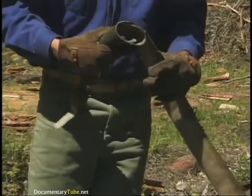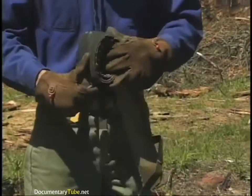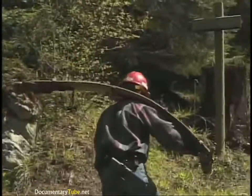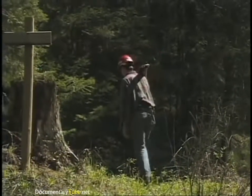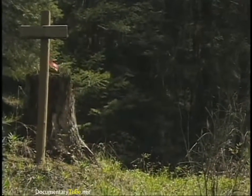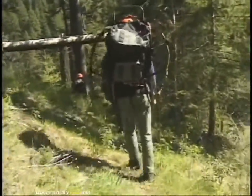And if you've taken your gloves off to tie the knots in the string or to remove the Velcro and then pick up the saw, it almost burns your hands, and I've seen people drop the saw suddenly. If you're not going terribly far or with a shorter saw, you can put it on your shoulder with the teeth facing away from your neck, take off the rear handle, hold on to the front handle, and carry it that way. You wouldn't want to leave them strung for long, or they might hold the bend.